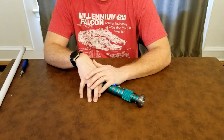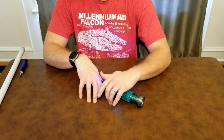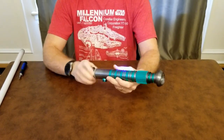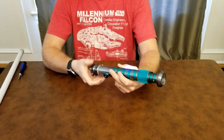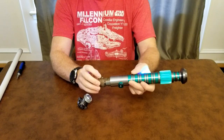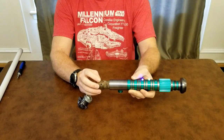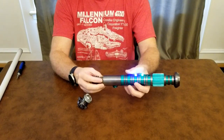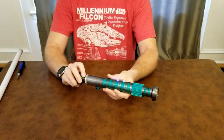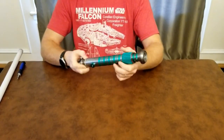Inside here it's a Saber Essentials 28mm speaker. I got a Goth chassis, all-in-one, 1.24 inches, which is standard for the MHS hilt v1 models. There's a 1.3mm recharge port, a kill switch, a high-amp kill switch, and a 21700 3.7-volt battery.